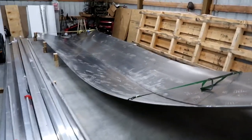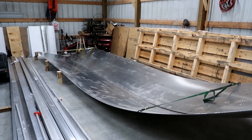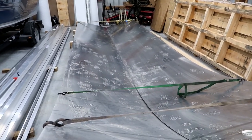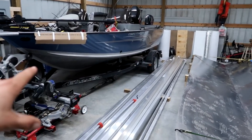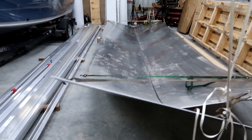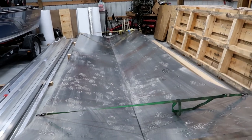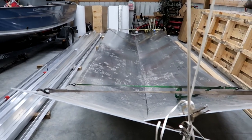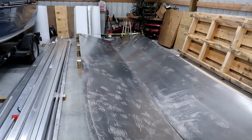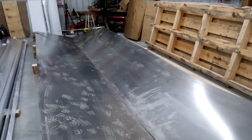This is what the boat's going to look like — she's 24 and a half feet long. It's a big boat. Going to stick 28-inch sides on her. It's going to be a barge that cuts through the water real good. That boat there has a 15-degree dead rise and comes up to about 35 in the front. The flatter the dead rise, the rougher it is in bigger water. This boat should still draw about only a foot, and I'll put a jack plate on the motor so I'll still be able to get in fairly shallow water.